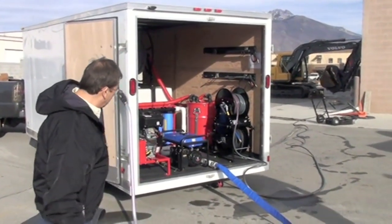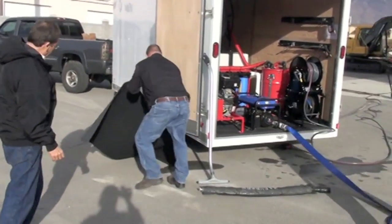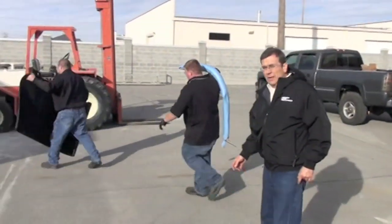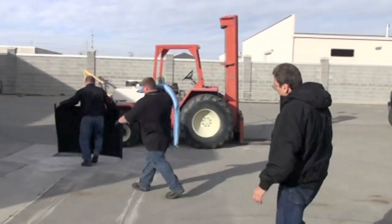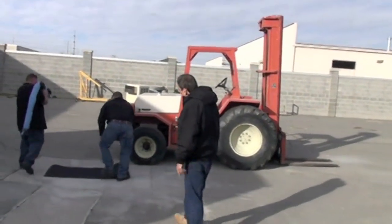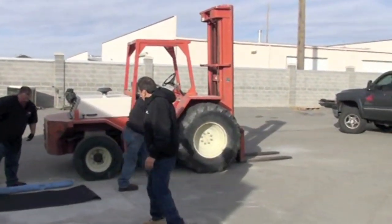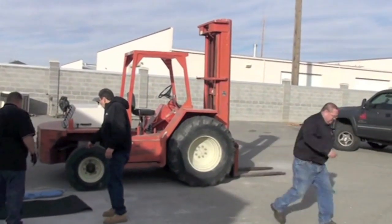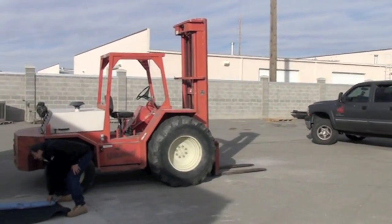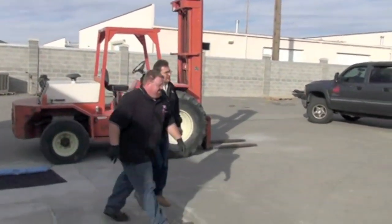So we're going to grab our suction devices and a drain cover. It's a solid plastic drain cover. Some municipalities might want to use something a little bit better. But you want to make sure you're sealed off because the drains feed the public waters. And so we want to get that up. You want your edges down. And so we're covering that up.